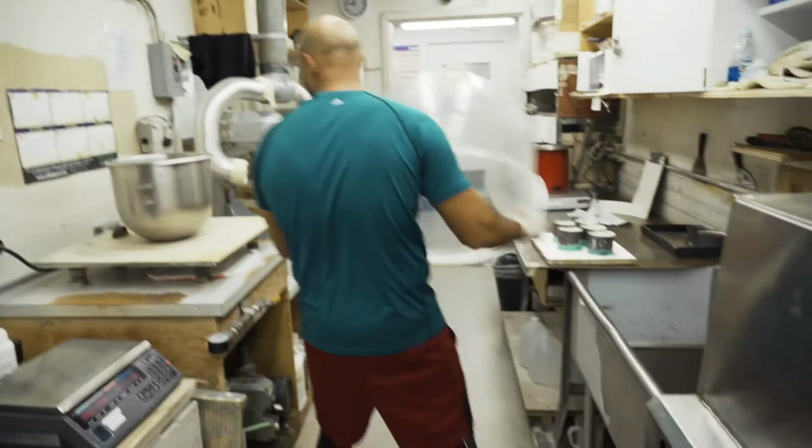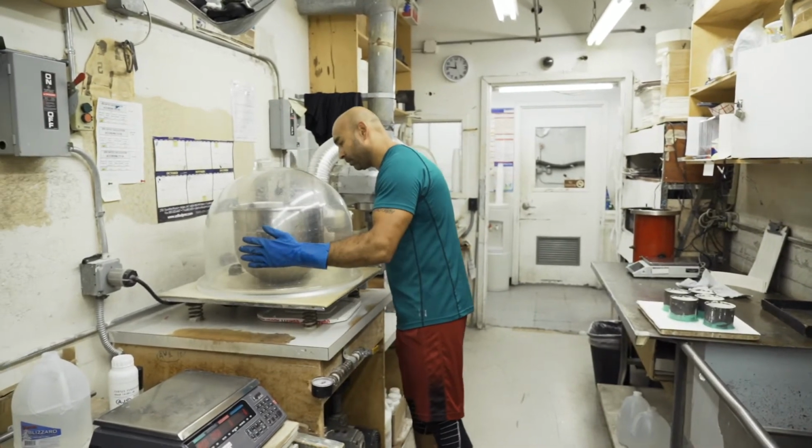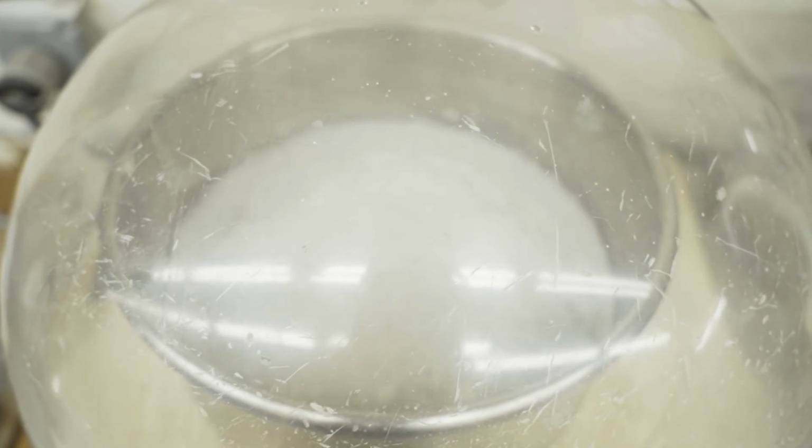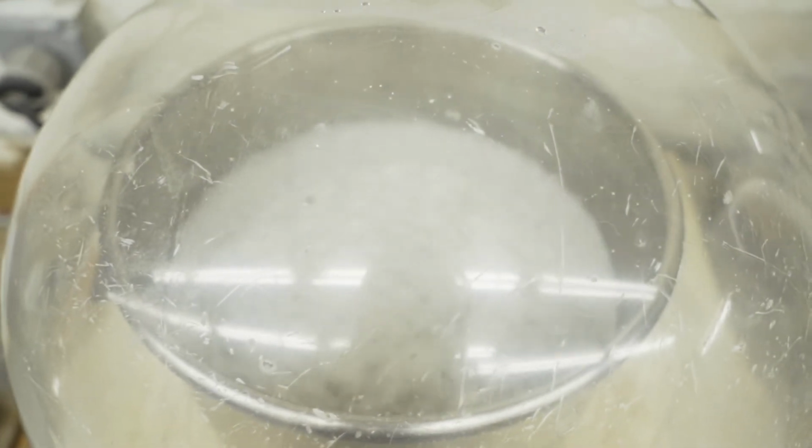After the mixing cycle has been completed, place the mixing bowl under full vacuum until the slurry rises in the bowl, breaks from the vacuum, and begins to boil vigorously. Continue to vacuum slurry for 1.5 minutes.